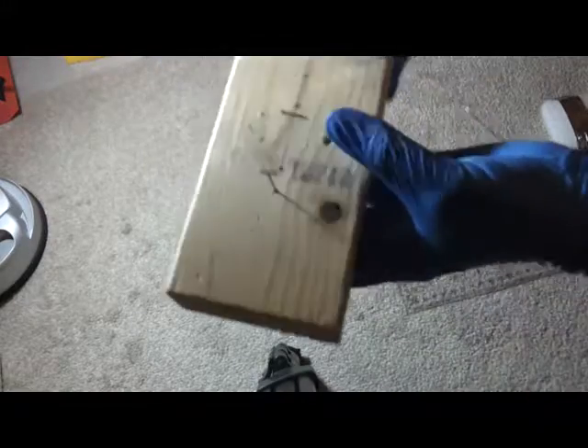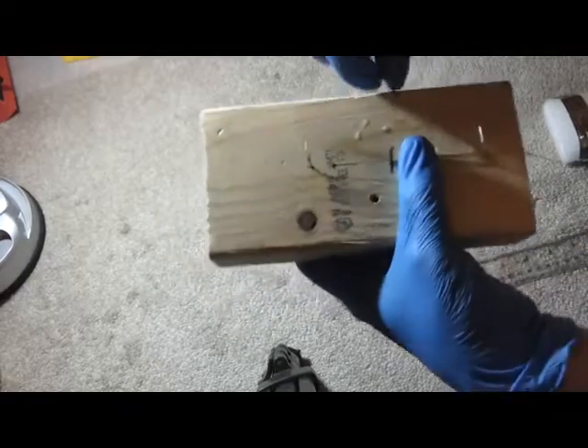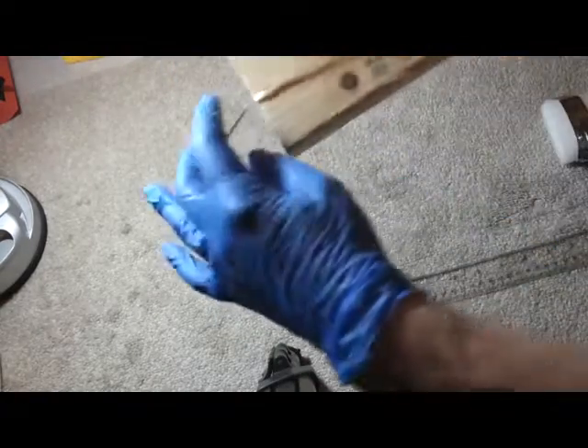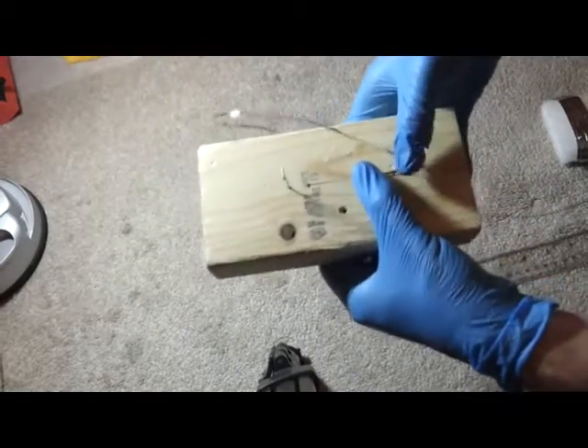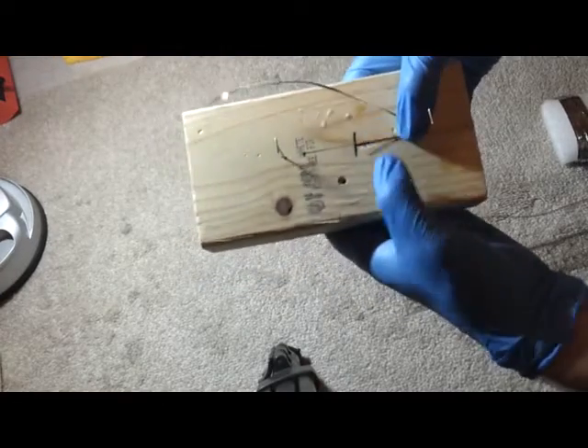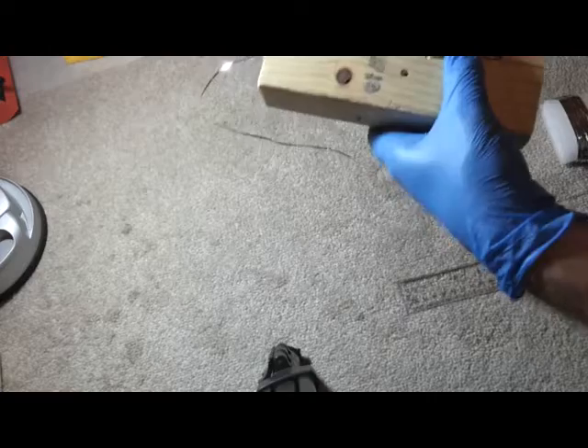To measure your tabbing wire — say you want it a little over 3 inches or 3½ inches — you start off with your tabbing wire in the middle lined up with that halfway mark, then wrap it around one pin and wrap it around the other end. So there's one round.